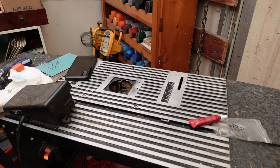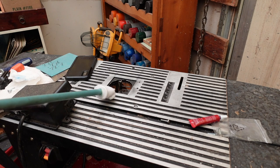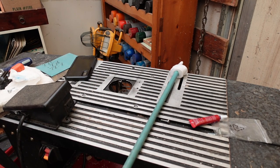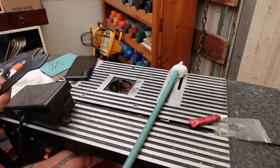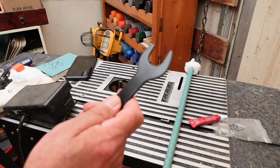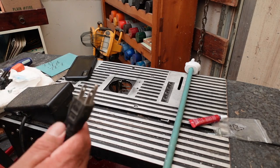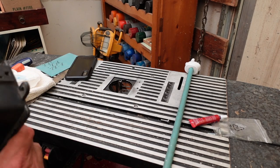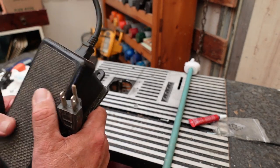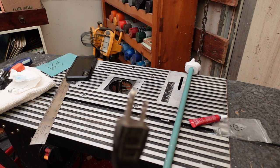I've put a bit on the router. Some of these have a large capacity for a bit, some have a collet in there for smaller bits. This is the bit I use to do my necks. This router has a wheel lock right next to here where you just put your finger in - again, power off. It's got a wrench; keep this wrench near the router so you're not hunting for it. Now the power for the sewing machine paddle is undone but we're going to plug the router in the right way.